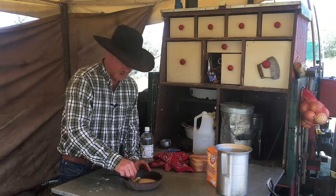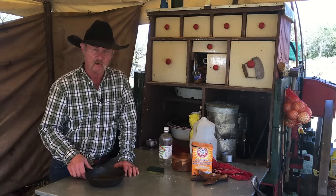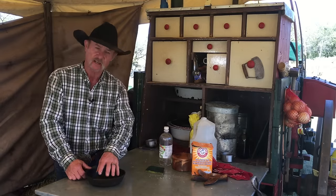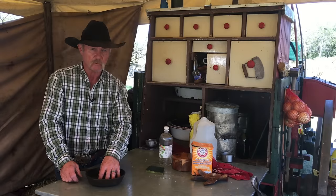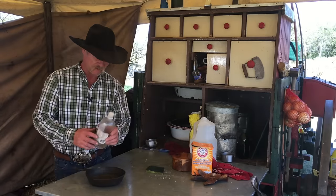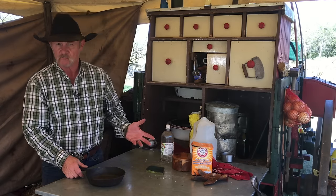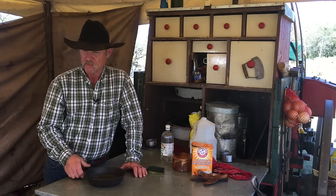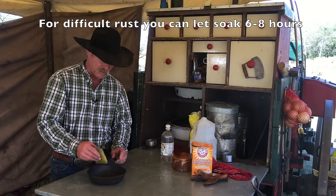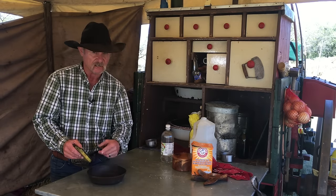The water's sort of turning a rusty color again. When I rinsed it all out with good warm water, that's when I noticed this thing was in worse shape than I thought it was — there's still some really deep pockets of rust. Warm it up gradually, just let it get good and warm. Then I'm going to pour straight vinegar in it — not that deep, let it come up above all that rust. I'm going to let it soak 30 to 45 minutes. Take the rough side of that sponge and get in there — you can see that rust turning loose, coming out. That vinegar done its job.